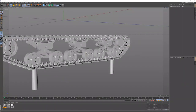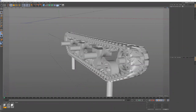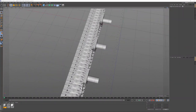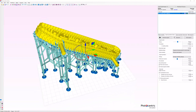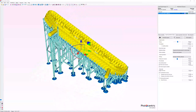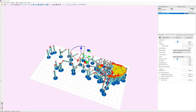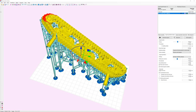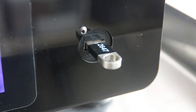Let's prep something for printing. This was one of the wheel and track units from my next project, the Sherman Cobra King from the Siege of Bastogne. It's modelled in Cinema 4D and exported as an STL file. In the slicer software, you can see I've had to rotate the part to fit it on the build plate. I've chosen to let the software automatically add the support material, and I'll start playing with the settings when I'm a bit more familiar with the printer. The slicer software works very well and allows me to see exactly where issues with the model need to be addressed.